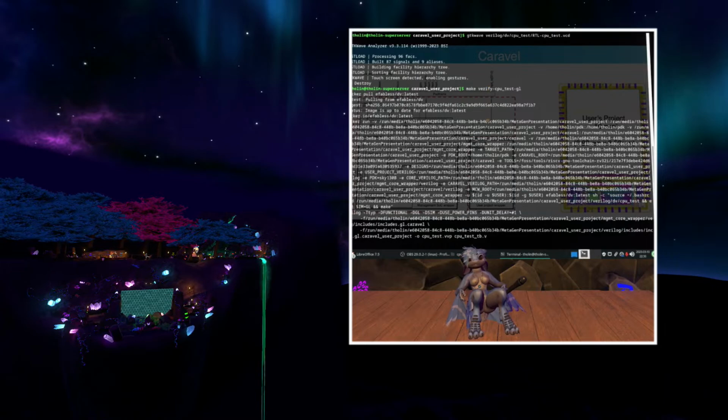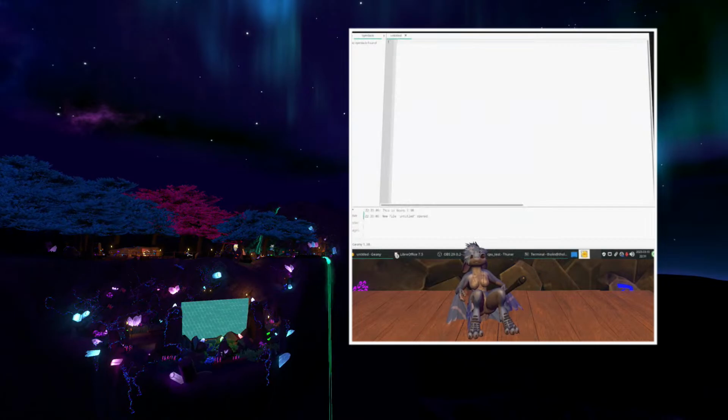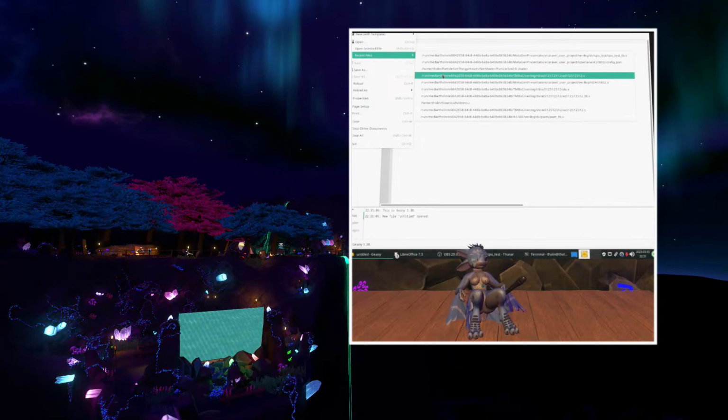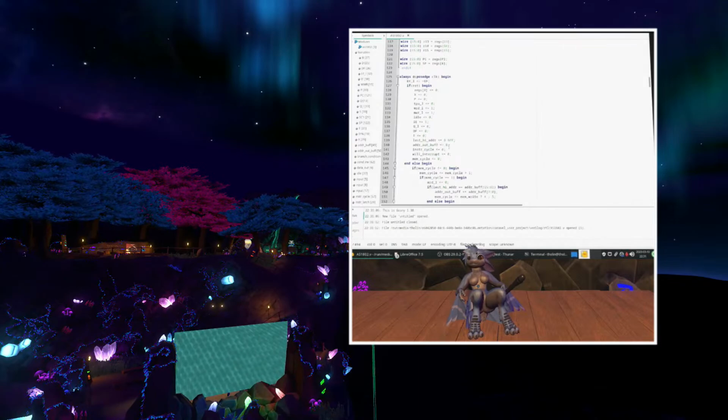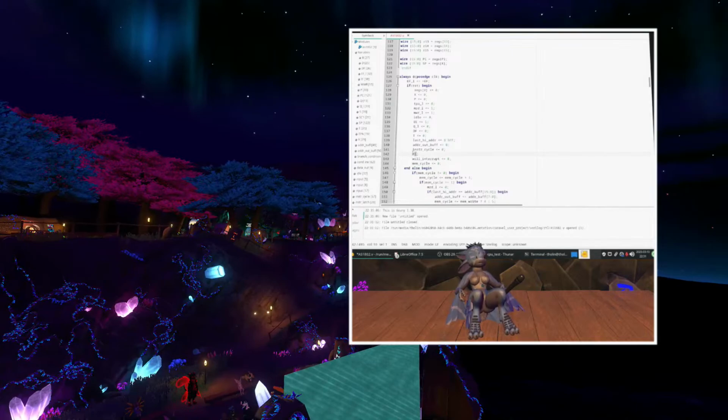I'll just pull this up again. If I just open up the source for this again, there. There's a thing you can do in Verilog, which is the delay operator. It's just a hashtag and a number. This means this is a delay. It basically means between everything before this and everything after this, introduce a 1 nanosecond delay. And so you can use this to actually simulate gate delays when running a low-level simulation.